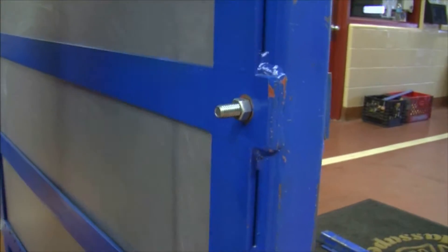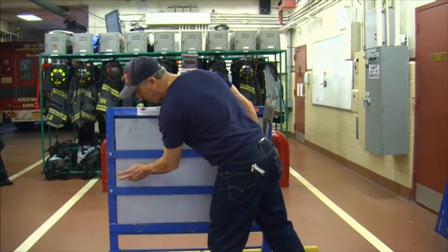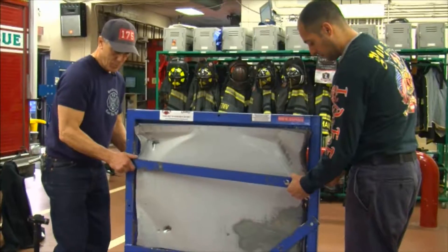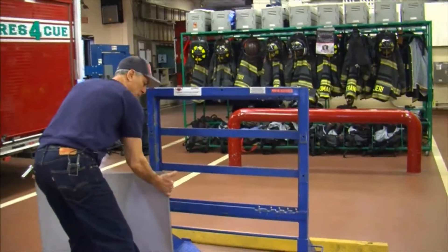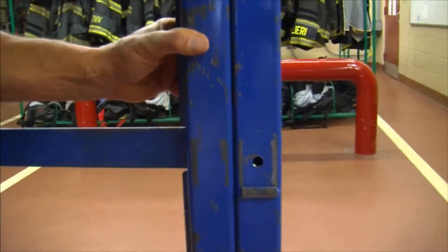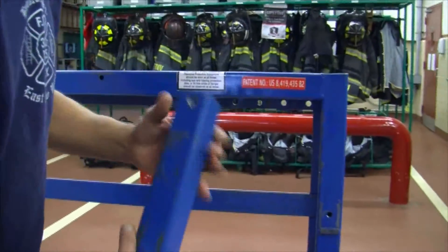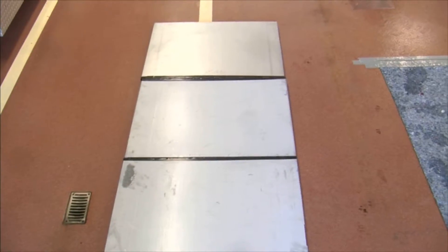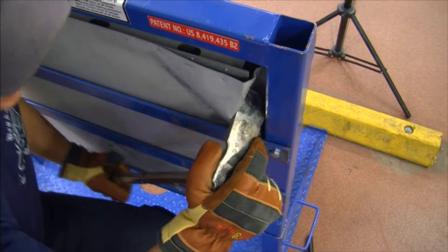Now with my Pro Bar, I can go through all the techniques — that's five forces. What I'm going to do is save the last one in the middle on this side for last. I'm going to take these two brackets off and put one of them down the middle, so that when we go in here for this last force, we're actually going to be forcing the door out. Say you don't have a 36-inch wide door — you just take this, drop it in, it bolts in at the top and the bottom, and this rides right along whatever width door, from 36 to 24-inch wide doors. This door gives you six different forces for a third of a door, so a full door gives you 18 different ways of teaching guys different methods to force the door out. I'm going to show you those ways and put it through its paces.